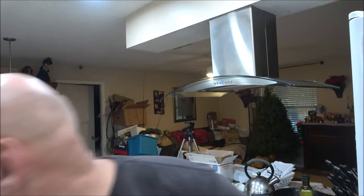But all these ice makers are kind of pretty much the same. They're not real hard to change. If I wasn't filming, I probably would have this done in about 10 minutes. So I was looking online. Somebody said it took them 2 hours, and I'm like, maybe if you're counting once the first tray of ice comes out. But what I usually do after I change these, I wash them out real good, but I clean it out with some Windex glass cleaner, and then I wash that off, and then I'll let it run a couple of trays of ice through it, then I'll dump them out, and it should be good to go.